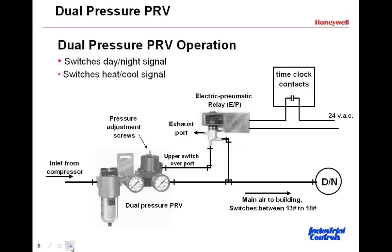This is just one of a couple of different setups that could be used. We have the compressor air coming in on the left-hand side, coming through tank air pressure on the left-hand gauge, then the right-hand gauge is the output main air pressure, and the main air line goes out to the building. This is labeled D or N in this particular case, or it could be summer-winter, depending upon the thermostats in the building, which could be switching air pressures for a day set point or a night set point.